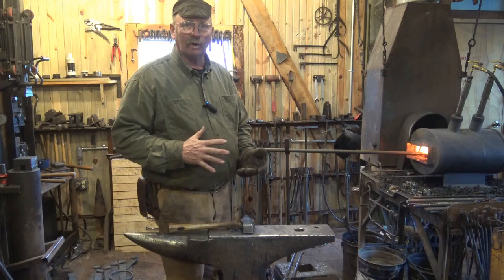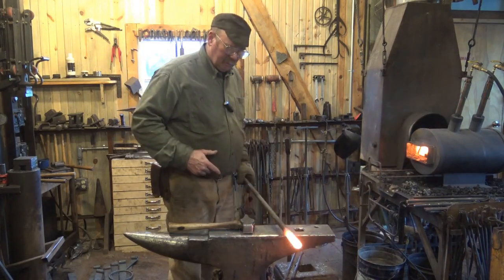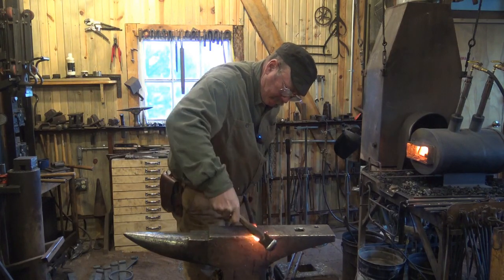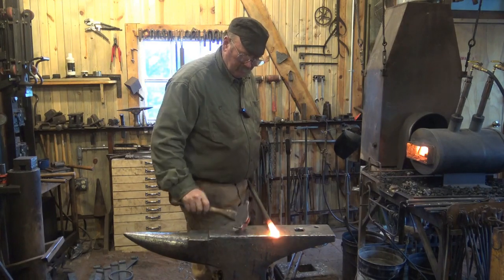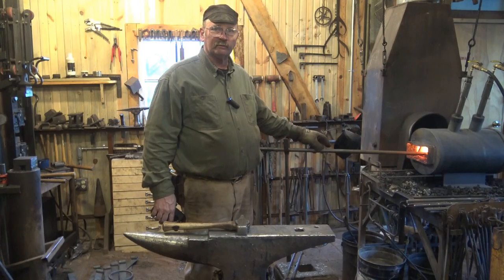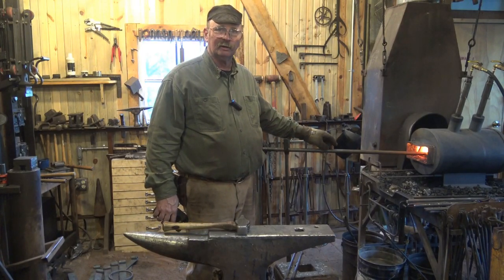You're pushing material into the length of the bar. Now, I've got this really long bar I need to upset, and I can stand here at the anvil and do this, and eventually I'm going to get that upset. But there's a better way. This bar weighs more than my hammer does, so I'm going to use the weight of the bar to upset the end of the bar. I'm going to use it as its own hammer.